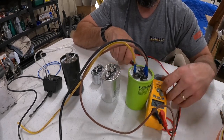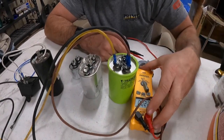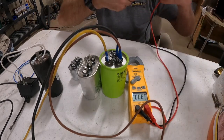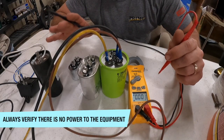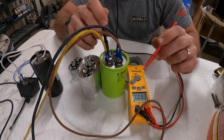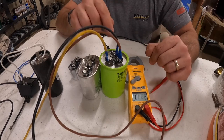To simulate this being in a unit — first off, you want to make sure the power is off. Go back to volts AC, and just because you turn the disconnect off or the breaker off, one time out of a thousand something's going to be bypassed by a hack. You can always go anywhere in the unit, preferably where the power comes in, and check a terminal to ground — check into each one, or at the contactor, wherever the power supply is coming into the unit.